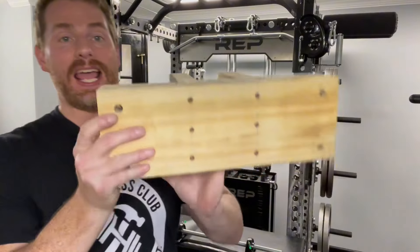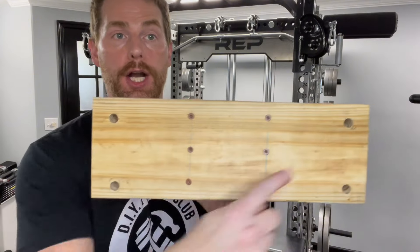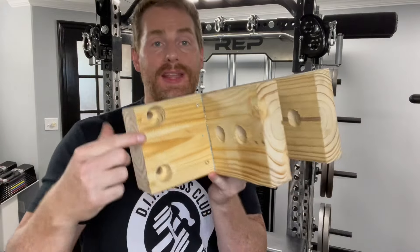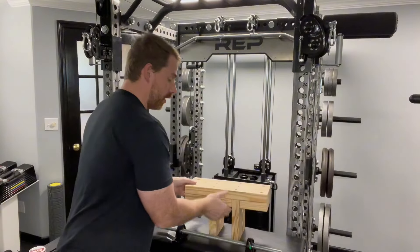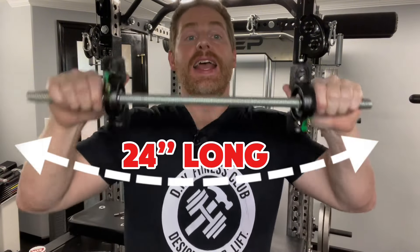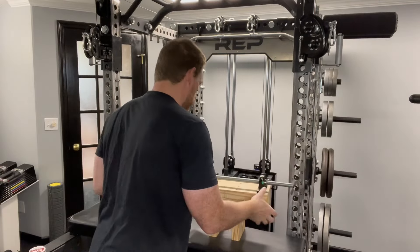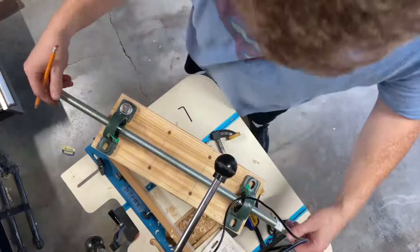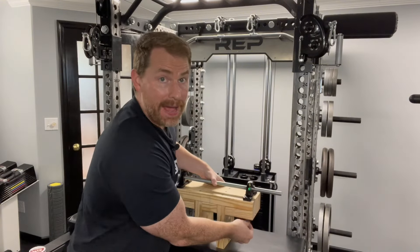The glue is now dry and it came out looking fantastic. Drill four holes — with counterbores on the backside so the nut and washer will be recessed in the wood. To figure out placement, use a three-quarter-inch threaded rod that's 24 inches long with three-quarter-inch pillow block bearings, and use the bearing holes to determine placement. Use half-inch washers that are one inch in diameter; don't go bigger or your counterbores will need to be larger.